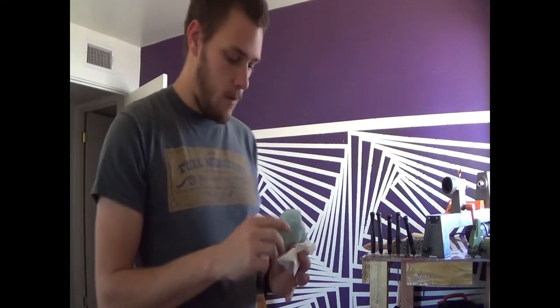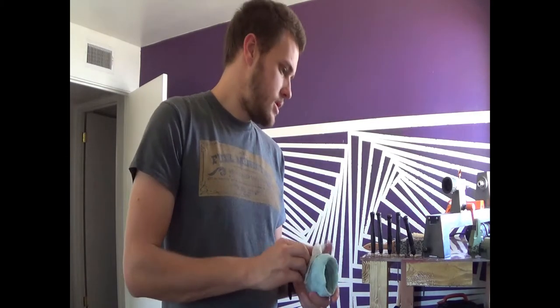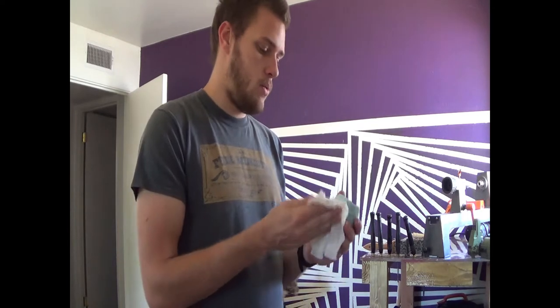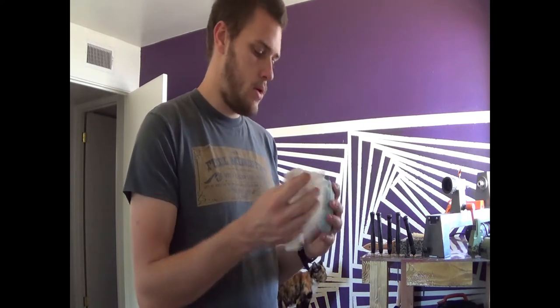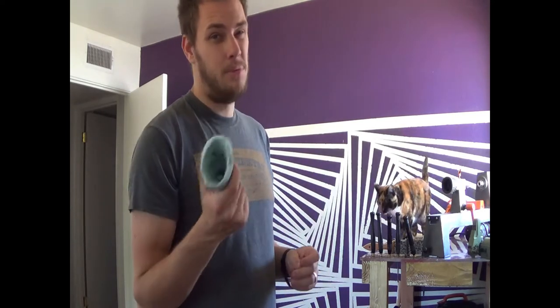The proof of concept is our molding material. It is made out of silicone and cornstarch basically, and we use water as an activator. Water reacts with the silicone making it dry and harden exceptionally quick. This honestly could have been demolded probably in about 30 minutes, but I demolded this in about 4 to 6 hours.